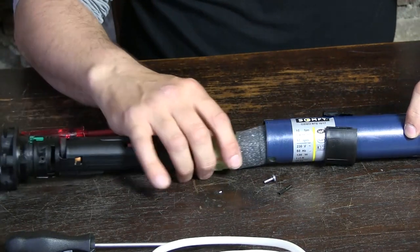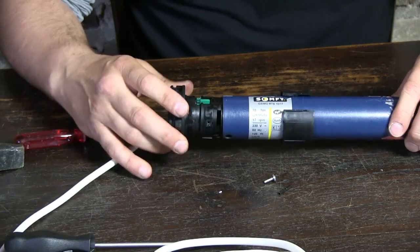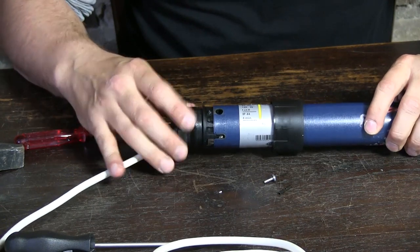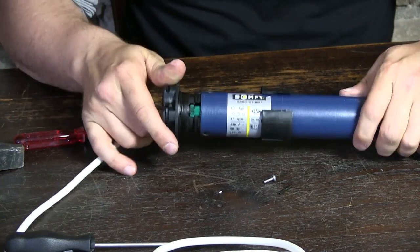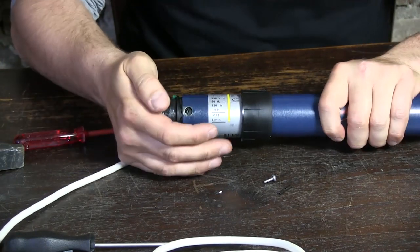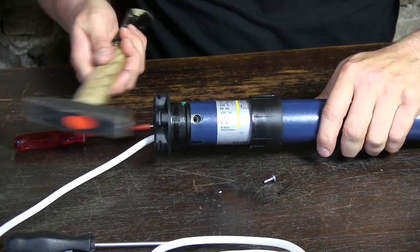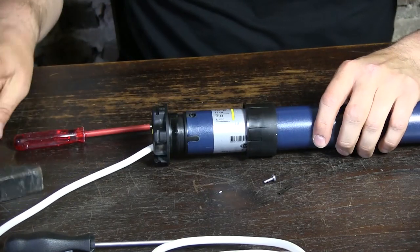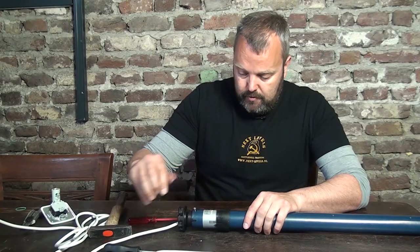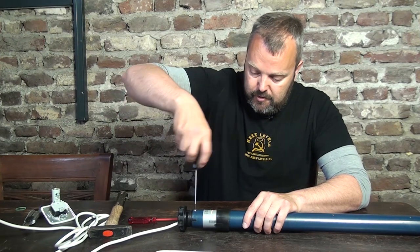But if you're done, you need to put it all back — slide it back in. Make sure everything is in the right position, so align this with the hole in the tube. You can also see that these parts will nicely fit into the slots. Push a little bit in, use the hammer if necessary. Then place back the screw and tighten it again to make sure the head is again locked into its position.